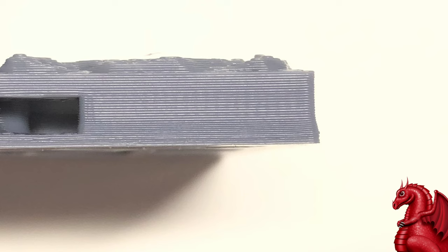So what we're looking at here is a Dragonlock tile that we do here at Fat Dragon Games, and this was done on a brand new Ender 3 V2 that I just assembled. And I looked at the print, and for the first few millimeters there, it's getting Z-axis binding. That's why it's looking squished out there. The print head is not moving up enough to allow all of the plastic that is allocated for that layer to come out cleanly. So since there is essentially too much plastic for the amount of height that it is moving up, the plastic is squishing outward, and that's why you're getting that wider base for the first, I guess it's about 3 millimeters or so. And then it's getting past the binding and able to move up the full amount it's supposed to, so then it levels out and the layers look like they're supposed to.